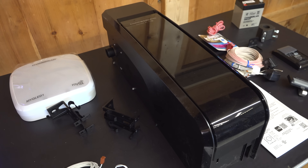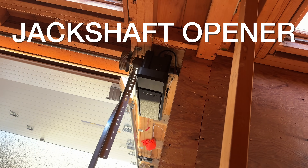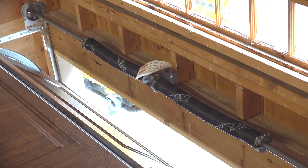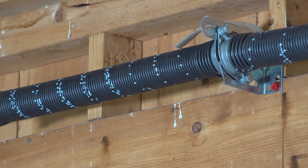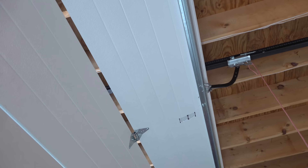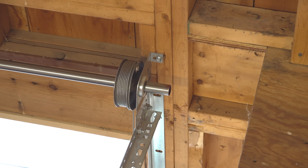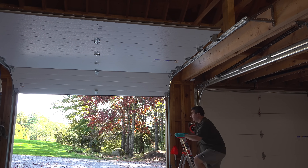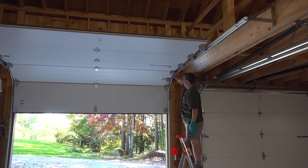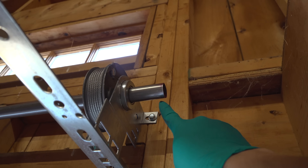The model isn't important — nothing in this video is sponsored. It's the type of opener that's important. This model is called a jackshaft opener. It all starts with the type of setup you've got. The spring you're looking at here is called the torsion spring, and this is the exact setup you can use for a jackshaft system. You can retrofit this to an existing system or even replace a standard ceiling-mounted opener. Normal openers have chains, belts, or even a screw drive. But this system is very clever — it uses the very rod that turns the garage door. Because the torsion spring creates the energy to help lift or close the door, you can simply rotate it by hand. This is exactly what a jackshaft garage door opener does — it clamps onto the end of this pipe and rotates it the same way.